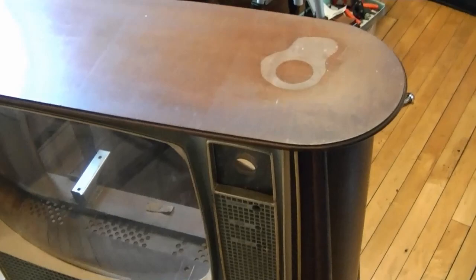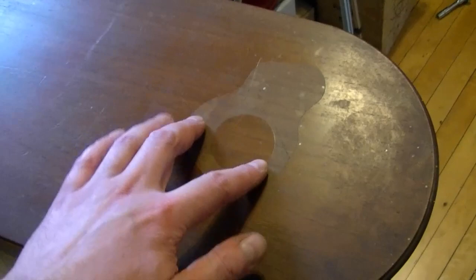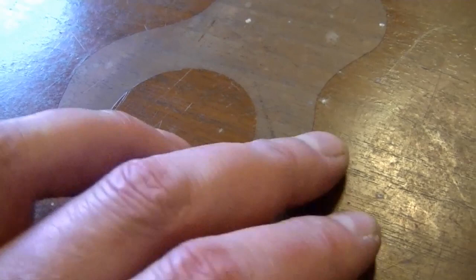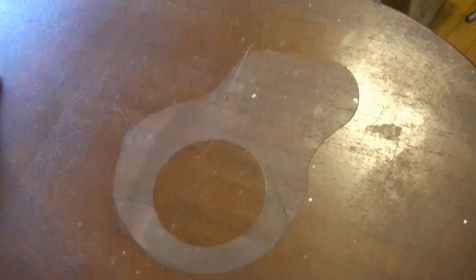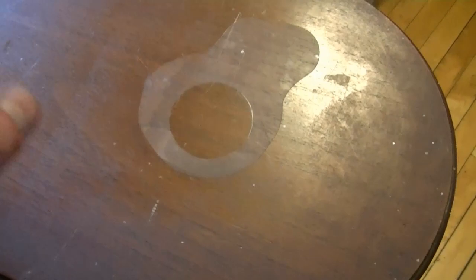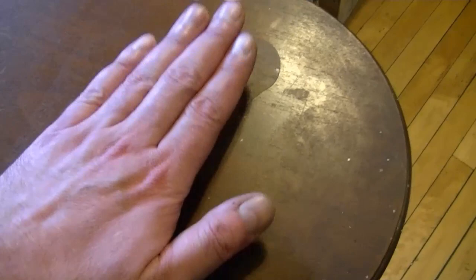While the CRT is out, I figure it's as good a time as any to do something about the top of the cabinet. As you recall, something clearly spilled here — that's not a watermark, the finish is actually gone. This is pretty much down to bare wood right here, with living finish in the other areas, so it's not the kind of thing you can easily touch up. I could spray on some new lacquer, I suppose. There might be a chance that if I put some finish on this, the color will be good enough, and I can sand after putting on layers of lacquer to blend it into the surrounding areas.